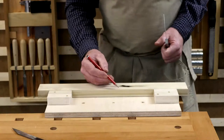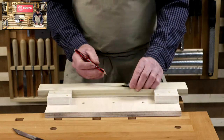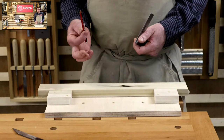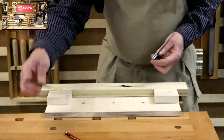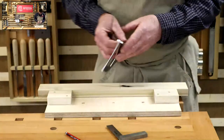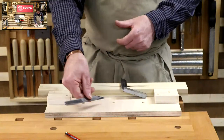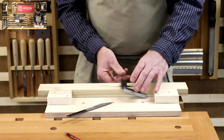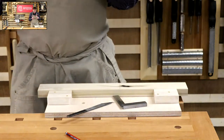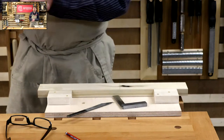We want to put our rail, and normally you'd measure this out a little bit more to be quite precise on where you want it. As we said yesterday, if you go with something like a pencil line, you get quite a thick line. So we want something thinner. Knife is so much easier. Now I've got different squares we can use. We could have a large Japanese square or an engineer square. Either will work beautifully to give me a nice support. I can clamp them on, I can hold them. Okay, so engineer squares are a bit better. They're metal. They are a bit more precise to my liking.